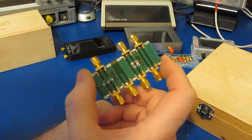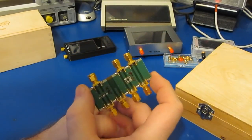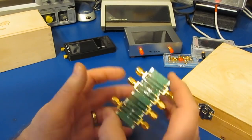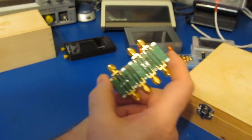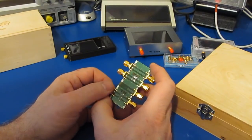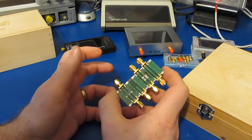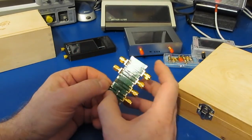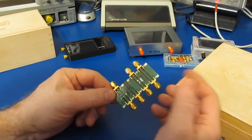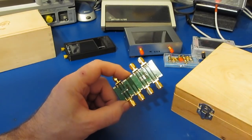My first vector network analyzer was made in the 1970s. That's an HP 8754A. That network analyzer has no computer, so everything is analog, but it had a storage normalizer that allowed me to connect it to a PC. So I do all the math using a desktop computer. That system supports the frequency doubler, so it can run up to 2.6 gigahertz. I've attempted to make measurements up that high and actually beyond. What I was finding is my homemade standards really didn't work very well once I got up above about 1.5 gigahertz. So over the summer I made another set of calibration standards.